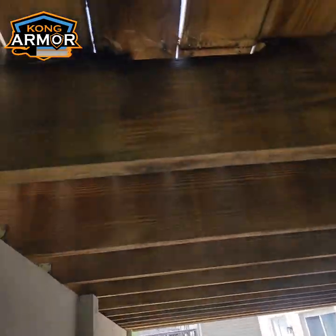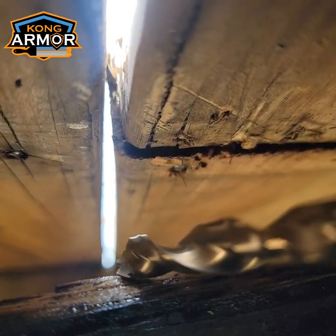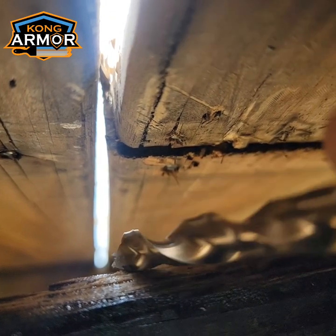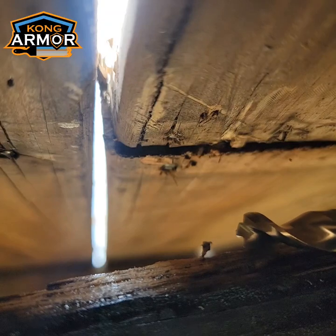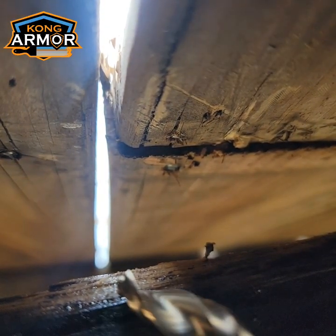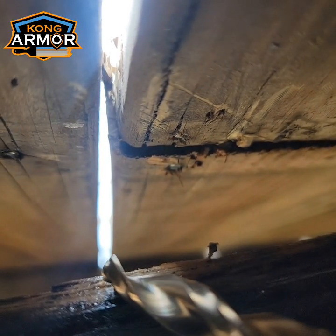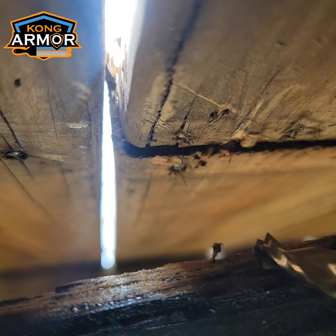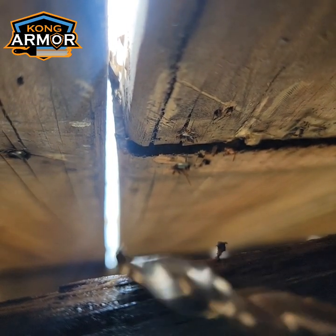All right, so now we've got this solidified up. So this rot up here, it's super hard, right? You can see the protective barrier over it. You see that gloss sheen to it? Any type of mildew, mold, or bacteria is not going to be able to set up on that, because it's acetone and acrylic. It's not going to want to grow on that, right?